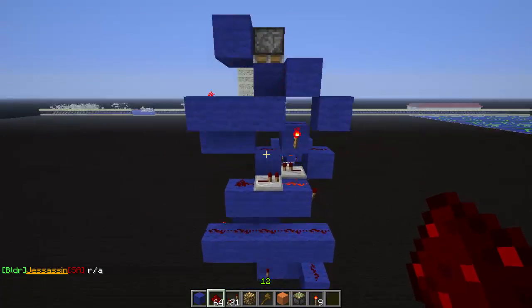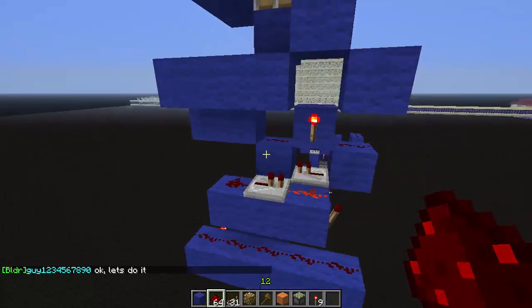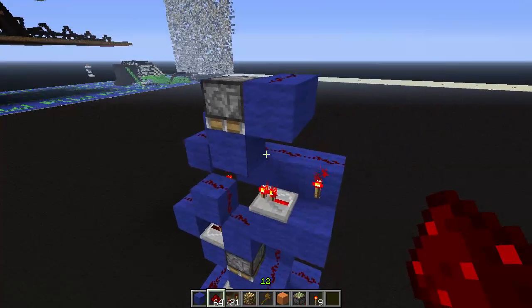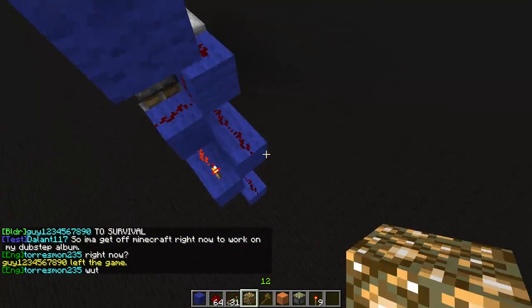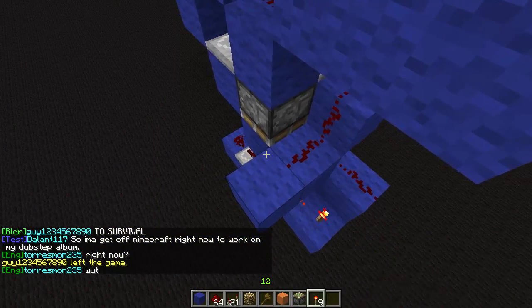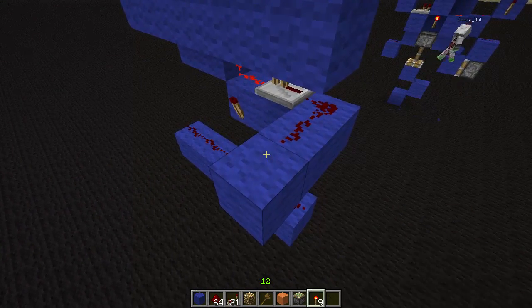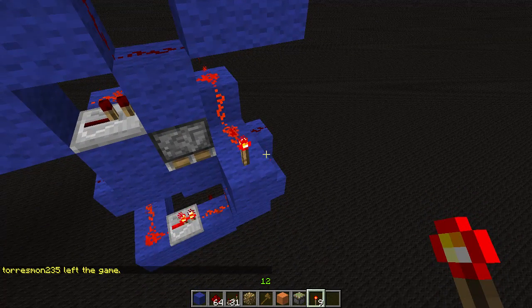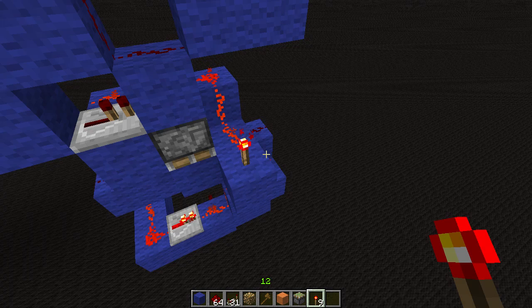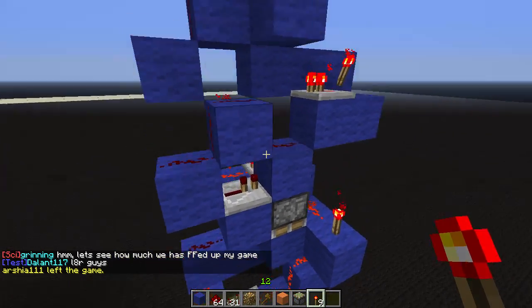I went ahead and finished up this RAM. You may see some similarities with the storage cell. The difference here is that we've actually got two different lines that you can read from. The major benefit is that while we're processing information in our CPU, we'll be able to load two values with one instruction — versus loading one value, saving it into register B, then loading another value and saving it into register C. You can load two values with one instruction, which saves time overall.